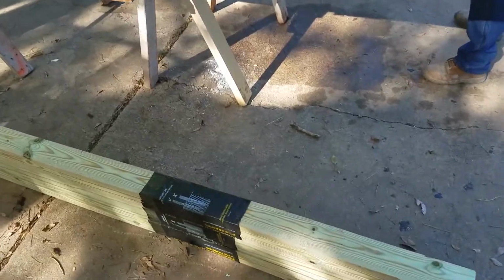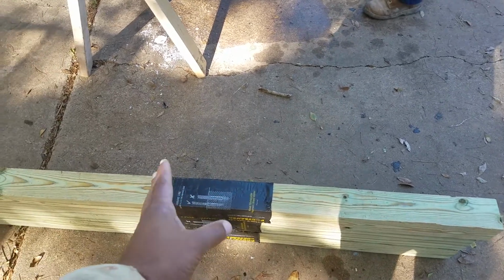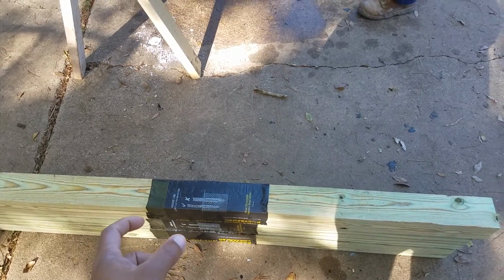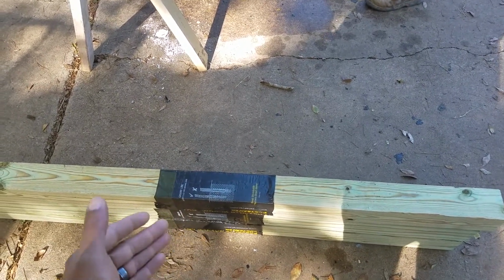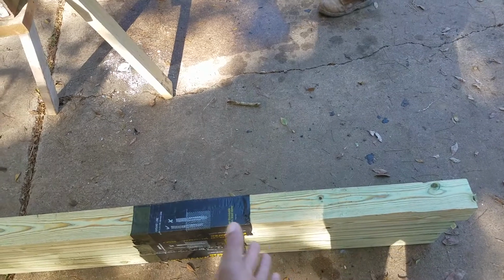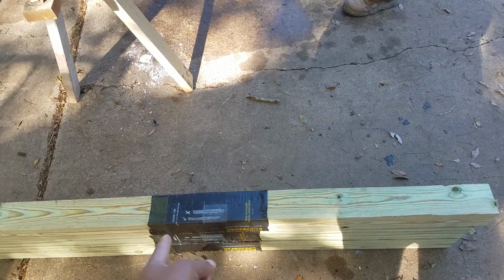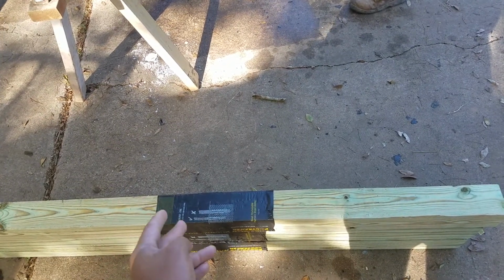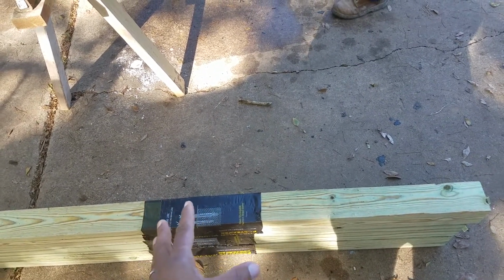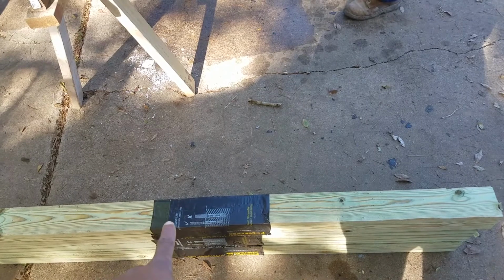And some of you guys may be asking, why don't we put it all the way down? Well, here's the deal. So your fungi and bacteria, things that eat the wood, they need oxygen and water and then somewhere to live. So they live in the dirt, and so they live right at the ground level. Below the ground level, it's more anaerobic, meaning there's not as much oxygen. There's still some oxygen, but they really like to live here where there's warmth, it's wet, and they can live there really well. So what we do is we protect only the part that's near the ground contact, near the surface where the ground contact and the surface meet. So that's the part we'll protect.